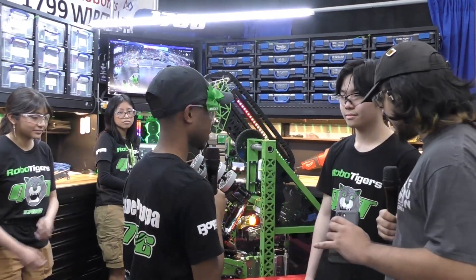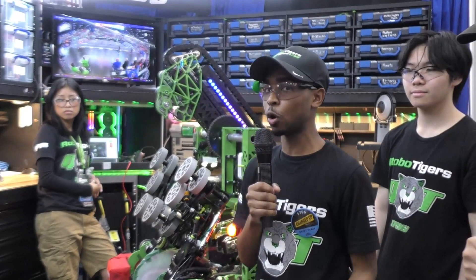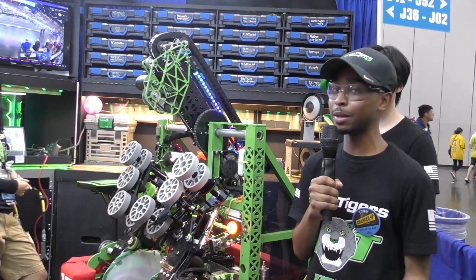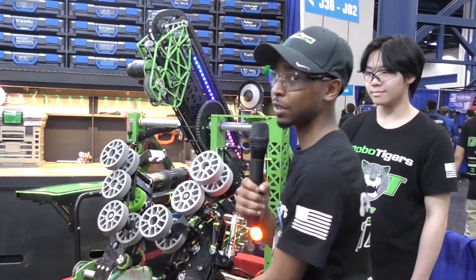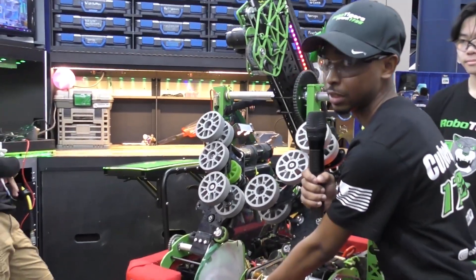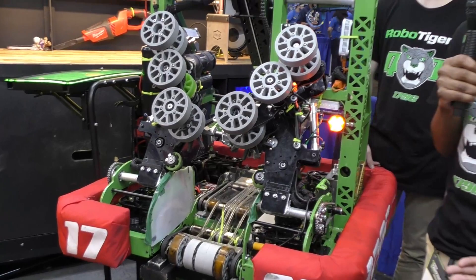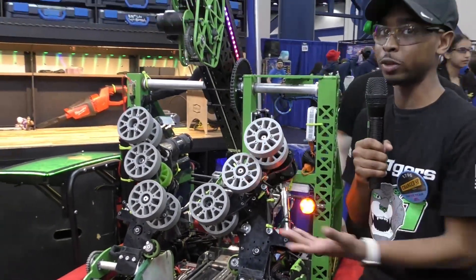All right Makai, let's start with you. Talk about your intake system and your indexer and how the game pieces flow. Is it meant for two game pieces or just one? So the initial design process for our intake mechanism was that it was actually made to intake both cones and cubes. However, once we got to our first event, we came to the realization that we can easily intake both game pieces, but we cannot effectively store both game pieces in our indexing system. So we adapted and overcame that, and we decided that the best route for us was to only intake cubes.